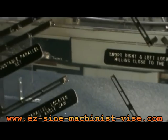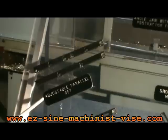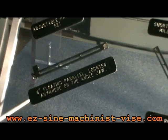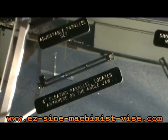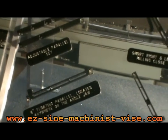These are the adjustable parallels. One fits on the angle jaw and one fits on the moving clamping jaw to hold a part as thin as 1/32nd or the full height of the jaw. This is the floating locator arm. It mounts horizontally on the angle jaw and is used to hold a part horizontally that's too large to hold vertically. You can hold a very long part and machine the top or the end of the part.